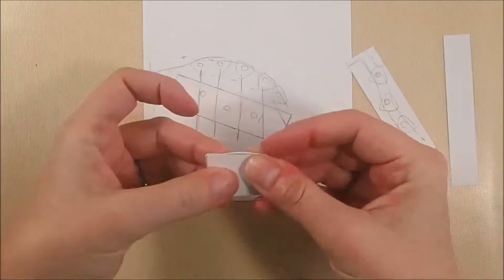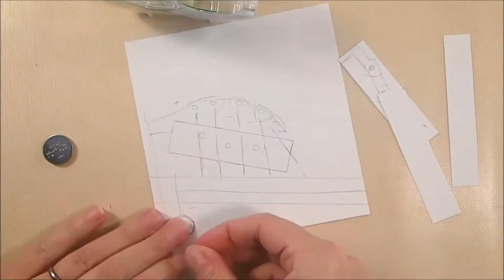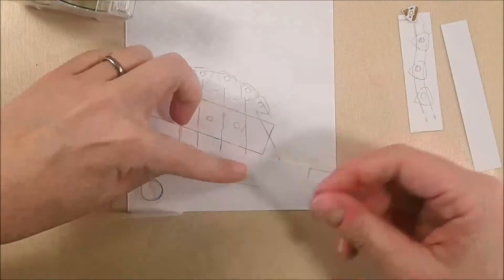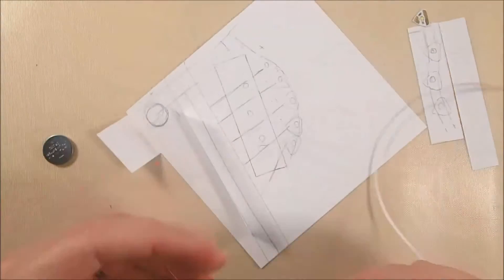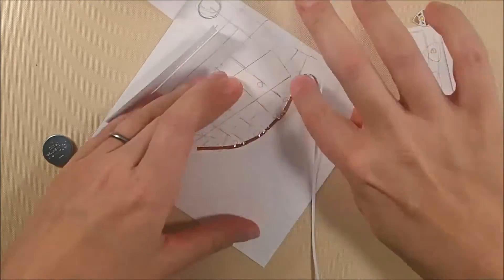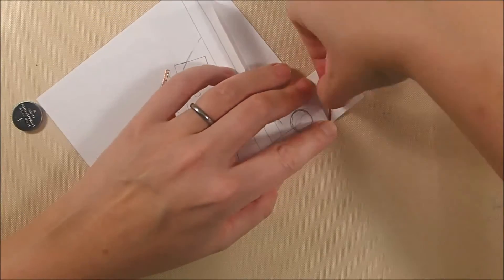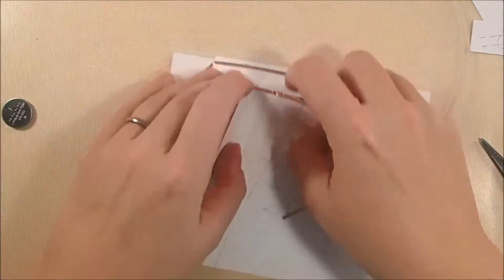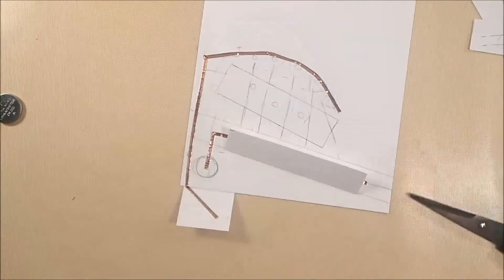Now to start off with, I'm adding a flap to the lower left. That is where I'm going to have my battery, and the flap is going to have the positive connection on it, which is the top of the battery. So when the flap gets pressed down onto the battery, the positive will connect to the battery, and the negative is going to be under the battery to make the connection. And then this is the flap that is going to have the area to connect our broken negative circuit to all of the individual lights up there, to make the do-do-do-do-do effect on the UFO. So I'm just running this straight across as I've drawn it, across where the lights are located and down to the middle of the flap. And then this is the negative that I am running across the bottom.